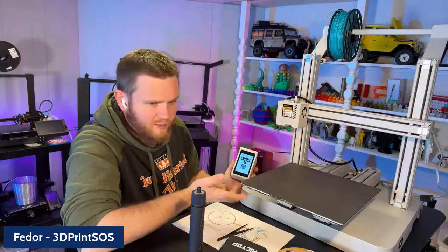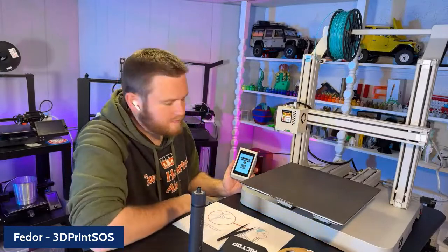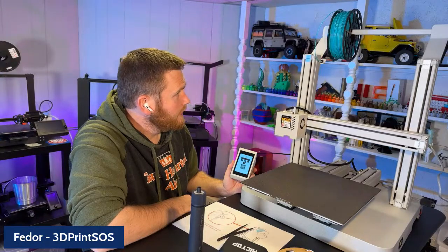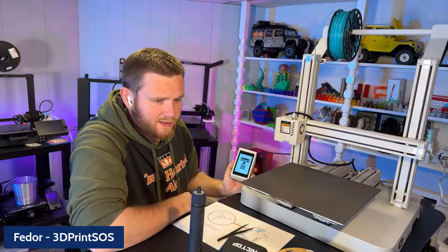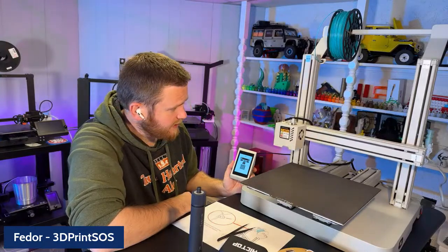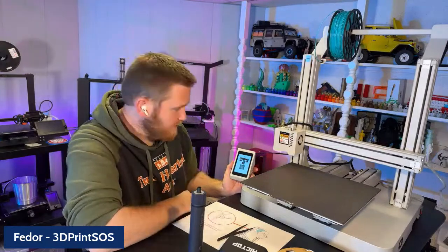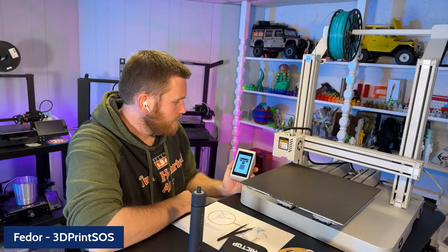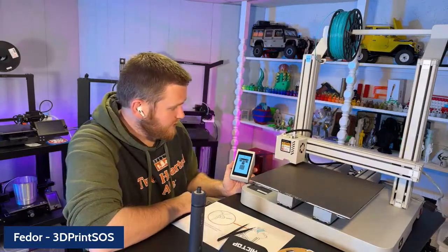I wonder what it's doing now since the bed is this far forward. I wonder if the 00 on this machine is here. I do like the fact that it did that calibration. That means that at least to itself, it's leveled in terms of the Z and the Y. So now we'll see how the ABL works. Right now it's not even over the bed. The bed goes a little bit further than where the hot end is. So when it's moving at this speed, it's silent. Okay, it ended up going where it needs to. That was the first point, looks like.